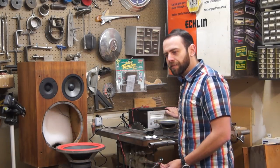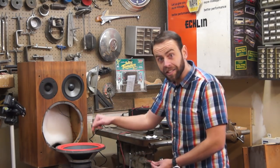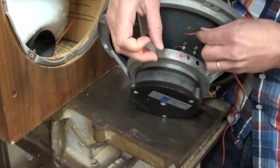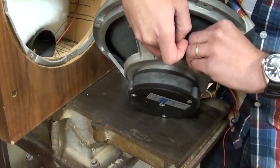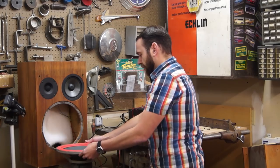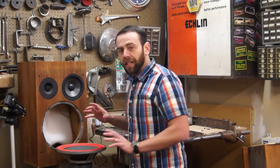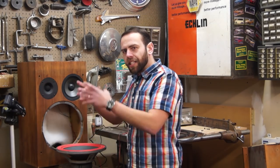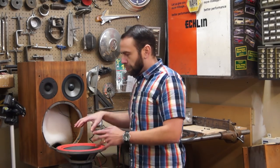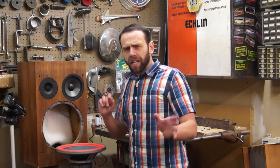Play that into a receiver at low volume — you don't want to blast it because there's nothing keeping the driver in at the moment since it isn't attached at the front suspension. Hook up the wires loosely; alligator clips would be better, but we just need a little signal. We're playing this low frequency tone on repeat and listening for a buzz. You probably won't hear 30 Hz directly, but you will hear if the voice coil — basically a tube with wire wrapped around it — isn't right in the center between the magnet poles, because it will rub. That can lead to a short which would fry your woofer and potentially your amplifier.